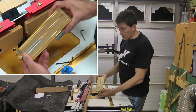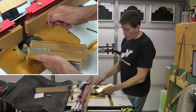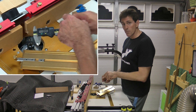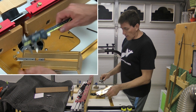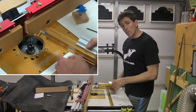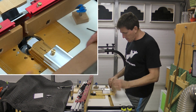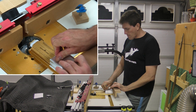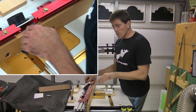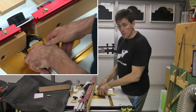This is where that little stop lock comes into play on the back of the groove center. In order to use the lock miter bit, we're going to loosen the slider for the front peg and set the digital calipers to the number we came up with — 12.6 millimeters for this particular bit — and lock it into place. Now we put it between the stop lock and the slider and lock it into place. We set up the fence just like we normally would for making the cut — put this into the collet, squeeze the stock, lock it into place, then adjust the fence forward until it bumps up to the fence on the groove center and lock it into place. I use stop locks in the back to lock where the fence is located. Now we can remove the groove center because we're done with it, and put the lock miter bit into the router.